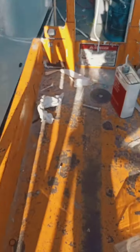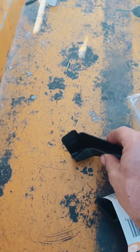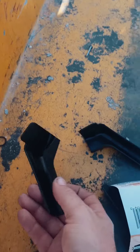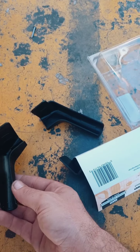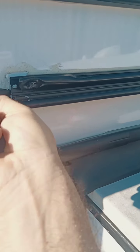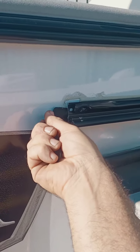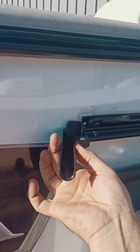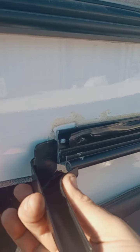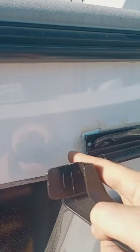So let's get our gutter spout here. You have a left hand and a right hand — this is the right hand and this is the left hand. Right now we're going to put the left-hand one on. Right here in this flat part is where that screw is going to go. You'll slide this back behind here, and you may need a screwdriver to pry it away from the wall. I'm going to go ahead and get it pushed back behind this rail right here, use a screwdriver to pry it out just a little bit, put it back there, and then we'll secure it back in.